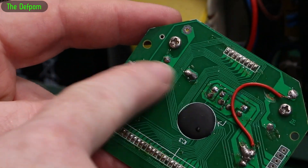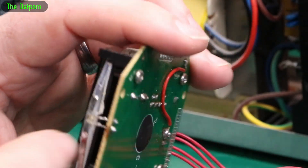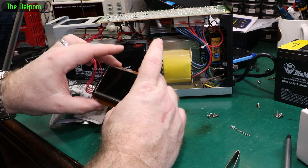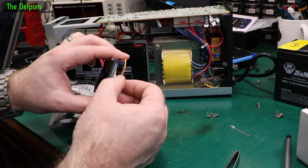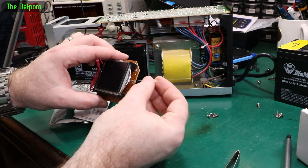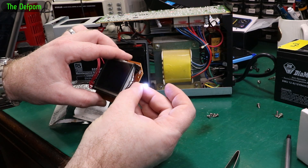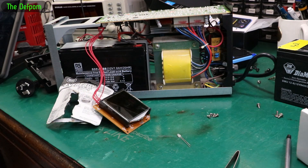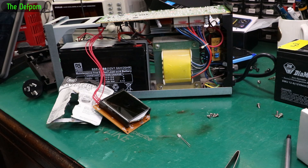The other side also has a resistor in it. Let me try and figure out the polarities and maybe try sticking another LED on the side to get some backlighting going. So I've just plugged it all back together and powered it up — the screen is on, which you can maybe barely see. There's actually no light at all from this LED — nothing coming out of it. I'm measuring voltage across it but it's not lighting up at all. So I've got another LED here — stick this across it and it lights up just fine. So what I'm thinking is trying to bodge this LED in somehow to make it shine into the backlight. The original LED is measuring a forward voltage but it's not emitting any light — it's just dead.